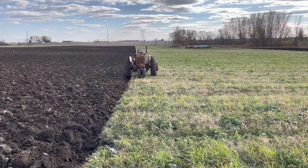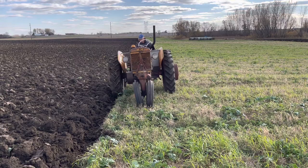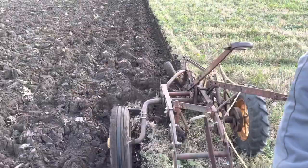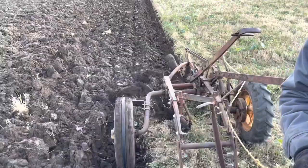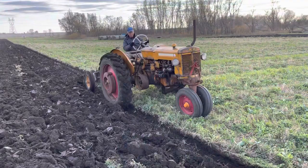In the field, forget theoretical locations — we need the tractor pointing forward. Adjust the hitch point so the line of pull passes through the right spot on the tractor while keeping the front bottom cutting the right width. Now the tractor points forward and both tractor and plowman are much happier. If your plow pulls crooked toward the unplowed ground, you will not fix that with a horizontal hitch adjustment — it is always a vertical hitch adjustment, or a fundamental problem like worn plowshares, worn landsides, or tail wheel adjustment.